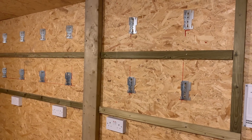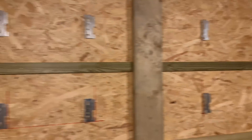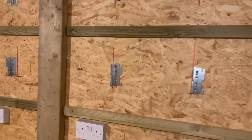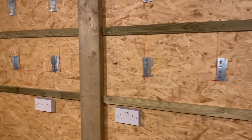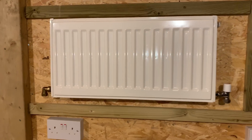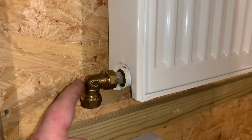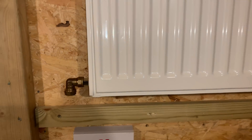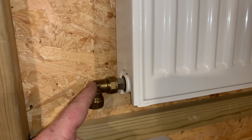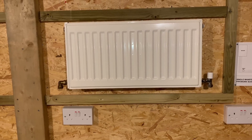I'm going to do this as a one-pipe heating system with six radiators. I've got my radiator brackets on the wall — upstairs across here and the brackets below for downstairs. When we used to install one-pipe systems they just had an elbow on. If you see a heating system with an elbow and no valve, there's a good chance it's a one-pipe system. As the years went on, sometimes people changed these and put TRVs on, which makes it a little bit harder to tell, but I'll show you some other ways.